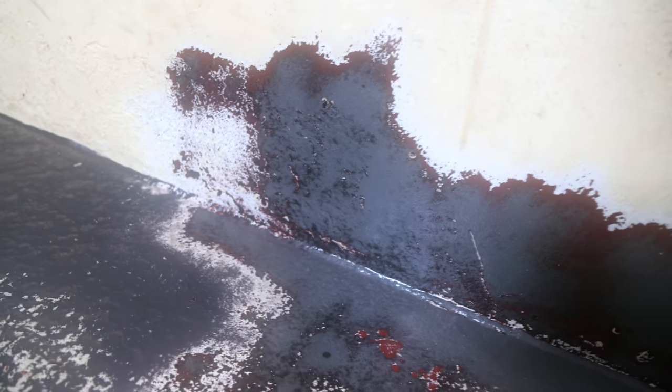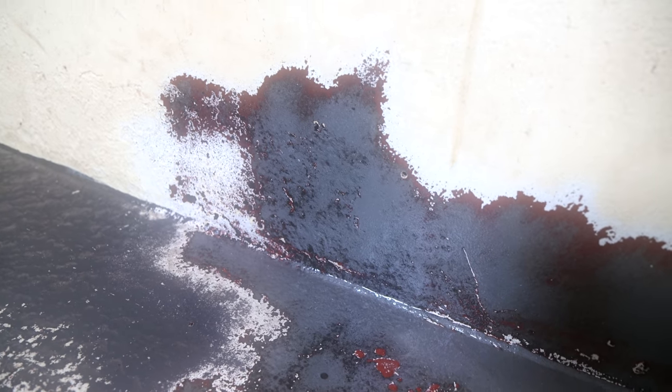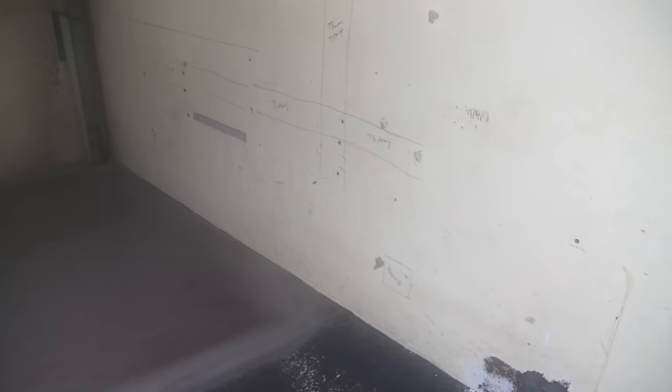There is a small amount of fog in this room, but blasting away, what I wanted to do along this edge of the wall, you can see there's crinkly bits of rubbish on the bottom of the paint. It's like there's rust beneath the paint. I don't know if there's rust beneath the paint, but I think there might be. So I've just gone in and had a bit of a blast, and you can see that black spot. That's basically rust. So I kind of confirmed the theory. I need to go along and blast about 6 inches right away along the bottom of that vertical wall.